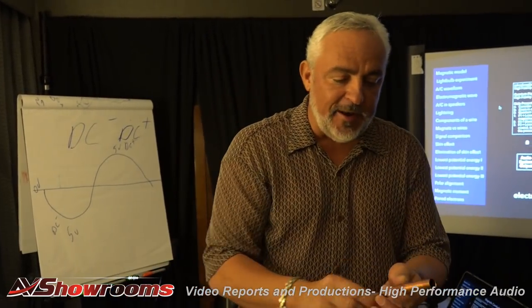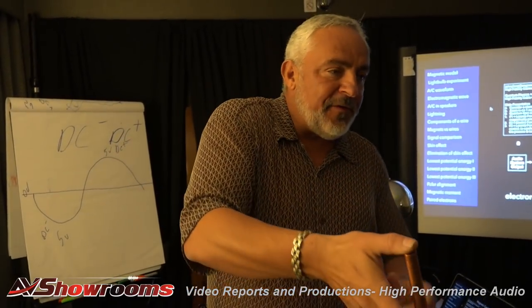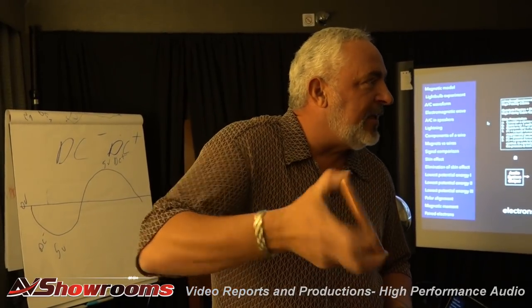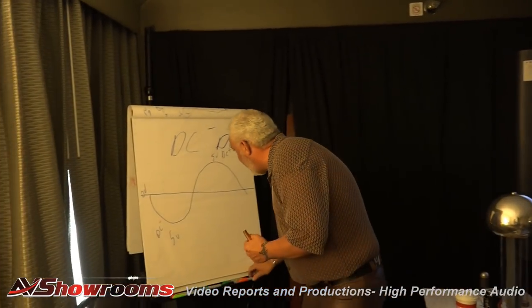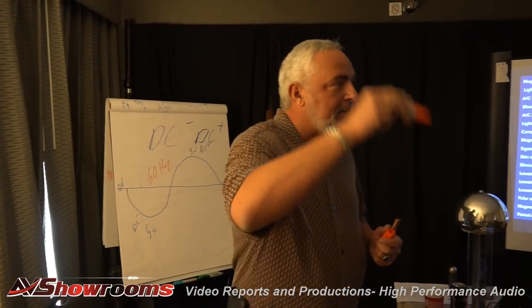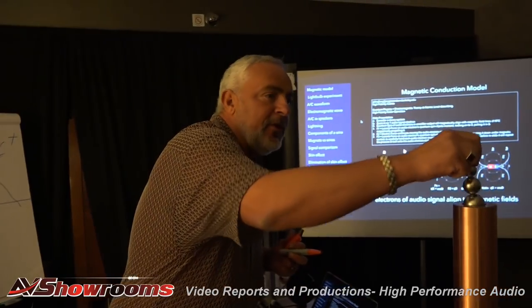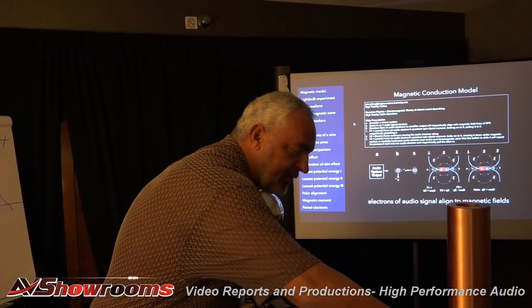And when you tap into that energy, it's basically coming from a power plant that works like this. So if I tip this up and down, I'm actually creating alternating current. If I was to do that 60 times in 1 second, that would be my frequency, so that I can have 60 cycles by moving that magnet back and down 60 times per second. Okay, so just literally that would be the same thing. That would be alternating current.